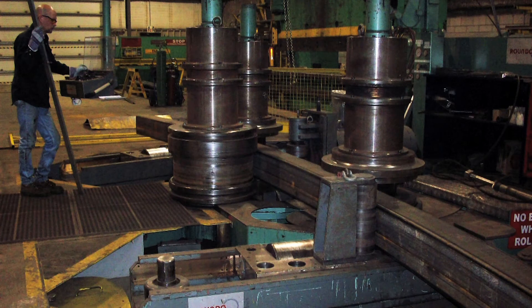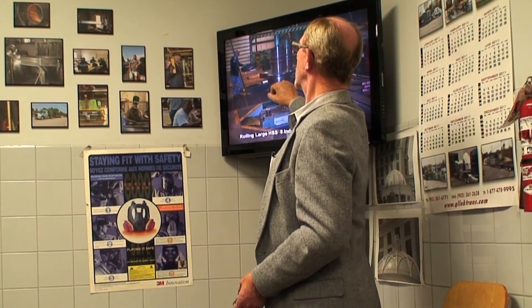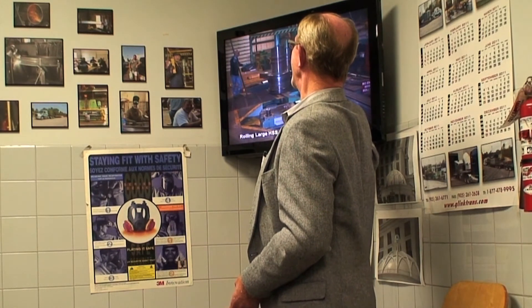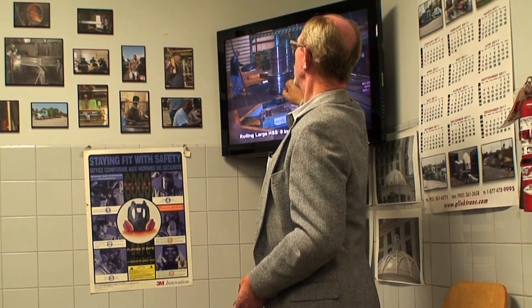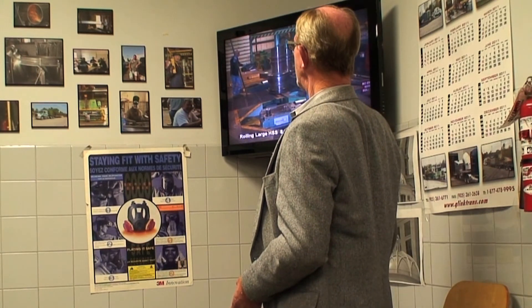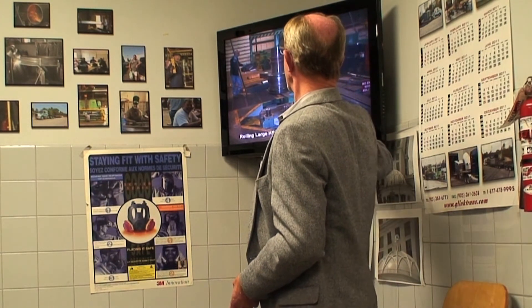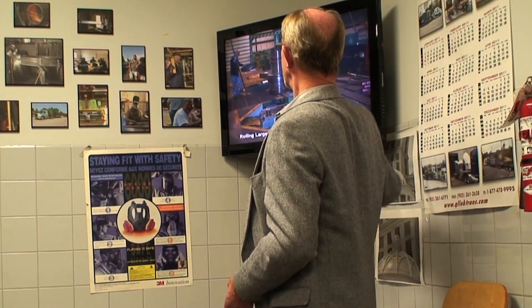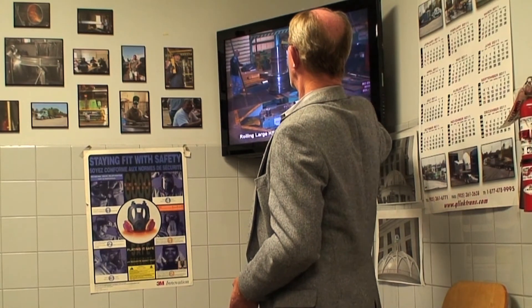This is an example of rolling a large HSS. These rolls are pushing to apply pressure against this roll, which creates the arc. There's also a roll here and another one you can't see in back that are being used to contain it. This roll is pushing against it to hold that arc, and it's also being guided along these rolls. HSS is probably one of the proportionally strongest sections that steel is made in, and it doesn't like to bend — it likes to stay straight, and it's difficult to roll. What often ends up happening is you get canning on the inside of this flange, because it's been compressed more on this side than you've got in the way of elongation on the other side.